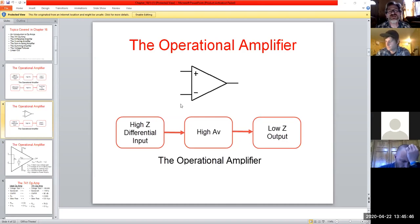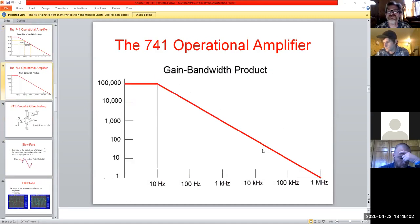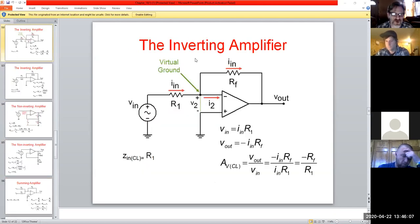So those would be my takeaways: E plus equals and follows E minus, I plus equals I minus equals 0, and the input impedance between these two is always extremely high. And then basically the two gain formulas for the types here, and that should set us up for what we're going to be dealing with as far as operational amplifiers.